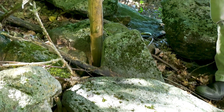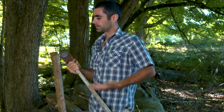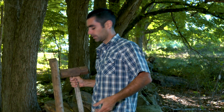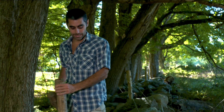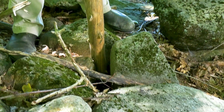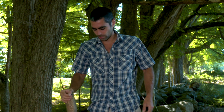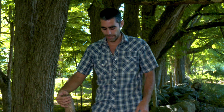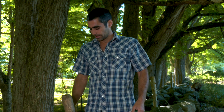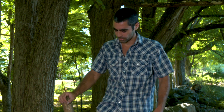I have my hole over here that I found with my rock bar. All I have to do is take my sledgehammer — a 16-pound sledgehammer; they're heavy and work pretty well. I get up on a high spot, make sure my footing is sound, and put that post in. When it stops, it stops, but you can see it's very firm. It doesn't have to go below frost line because the rock wall doesn't freeze or heave. And there's my post — it's going to hold pretty well. I learned this method from a 90-year-old dairy farmer and I'm glad to include it in this series.